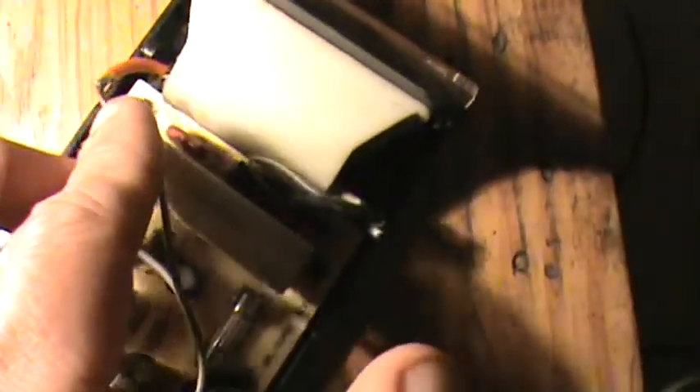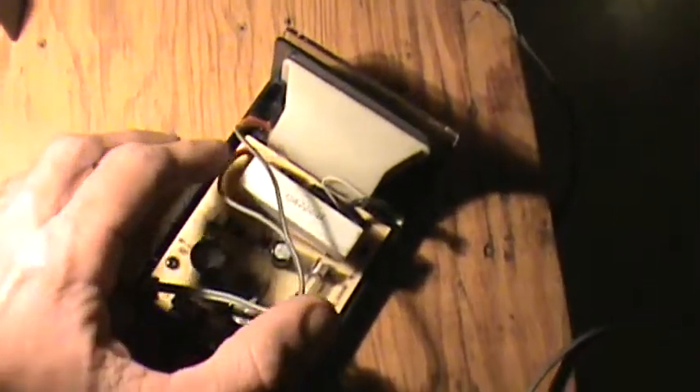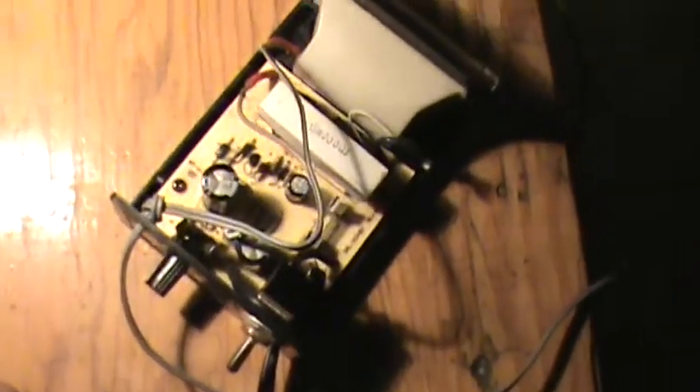You drill a little hole through the plastic and put the wire through, tie a knot so you don't mess up the connection. On the side of the strobe bulb there's one connection — you clip it and simply connect those two wires from your wand in between, so that every time the circuit pulses it also pulses through the coil, making a magnetic field as well as flashing the bulb.